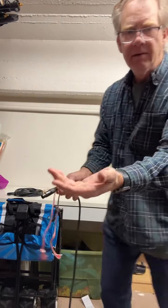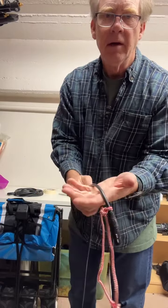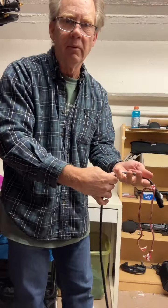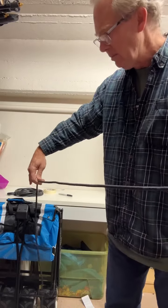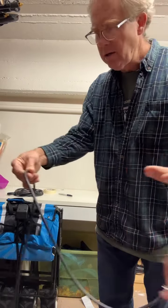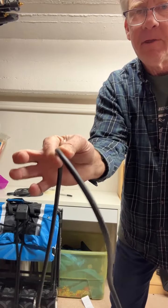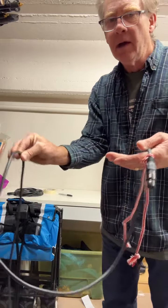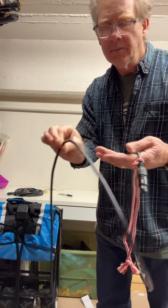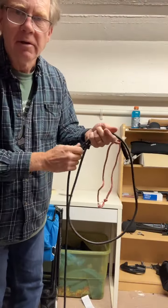On my left hand, I like to put the connector, one end of the cable, and in my right hand, I will guide some of the cable extending about 2 feet, and using my pincher, my thumb and my forefinger, I put some pressure on there. You wrap it down and create a circle approximately a foot in diameter or so.